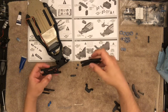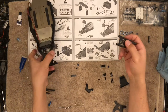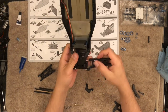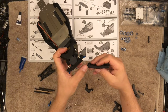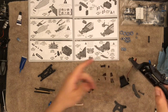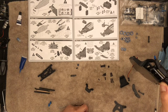We have to install the brace. Make sure that you ream these before installing with a three millimeter reamer. The brace — these little horns are going to go up. They sort of go here into the chassis. Then I can go ahead and drop this in, if I can get it into the hole of the metal brace.